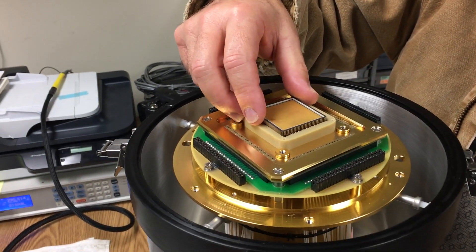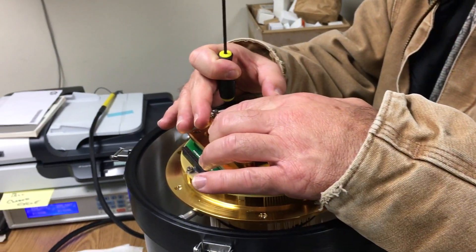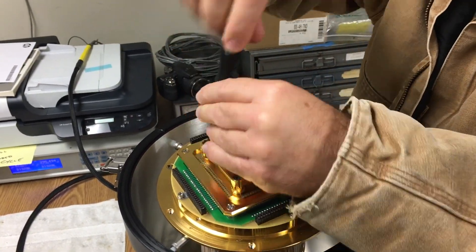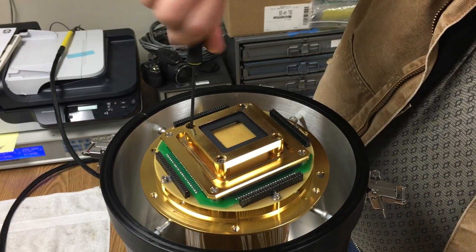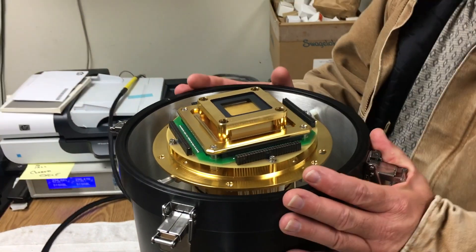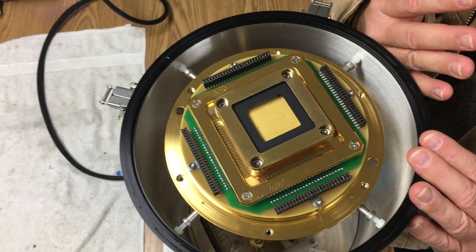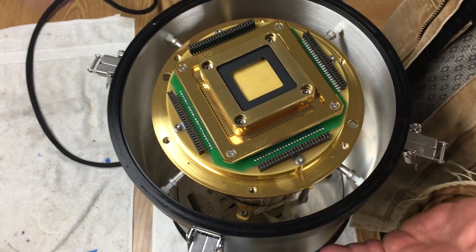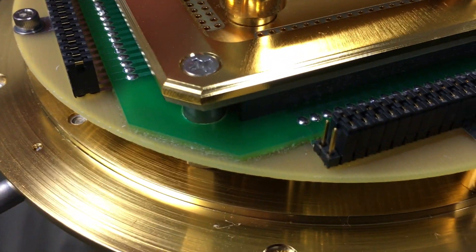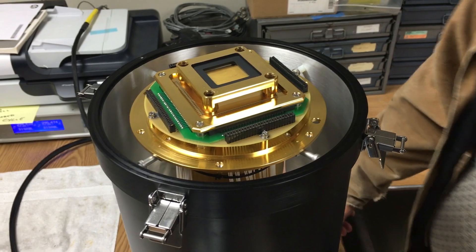It's just a blank carrier and a chip clamp. Now, because we have coax coming up here, you have a signal and your shields. Right now the shields are all tied together on this ground plane. If you wanted to isolate one of those shields, we have these shunts — I just lifted the ground off that line. When the shunt is in, it ties it to the ground plane.